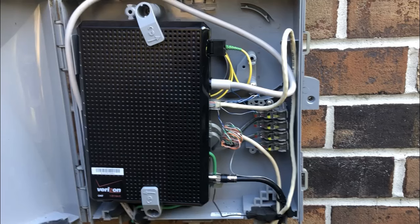Right above that we have our standard OFNR cable with SC connectors on the ONT side, and then a coupler below the ONT for the outdoor rated fiber cable, which goes back to the FiOS box that is basically right outside my home — it's very close.